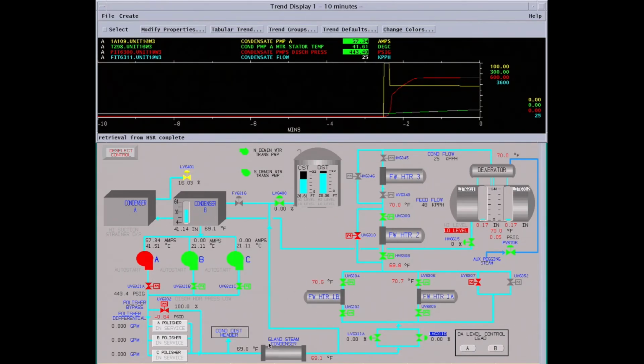It goes down to a condenser. Then there's a gland vacuum pump that keeps slight negative pressure on this just to keep a slight flow of steam and air through here. This adds about 1 degree to the feed water. It looks like our motor amps are starting to drop a little bit, so we're full. There's a recirc valve going back to the surface condenser. When your deaerator control valves are closed, it maintains a minimum flow through the gland steam condenser.